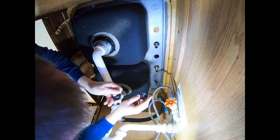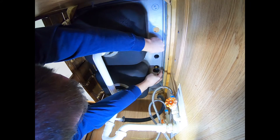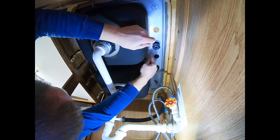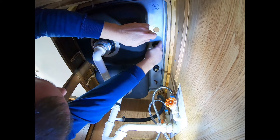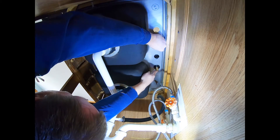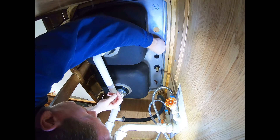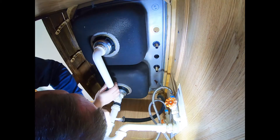Here are the two installation nuts. Put that on there — these didn't come with gaskets. Some faucets say to put plumber's putty around the base just to seal it, but this one didn't call for that and I don't think we need it. So just spin these up snug. See the center here — spin that up snug, spin this snug. Get this centered up. Not quite centered — loosen it a little bit. About there. I'm going to go up top to make sure it's centered.